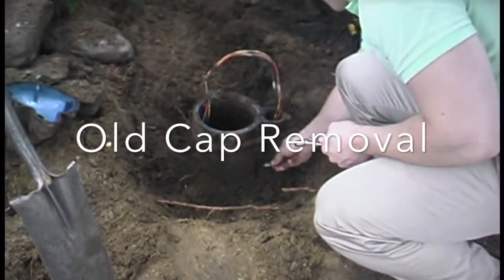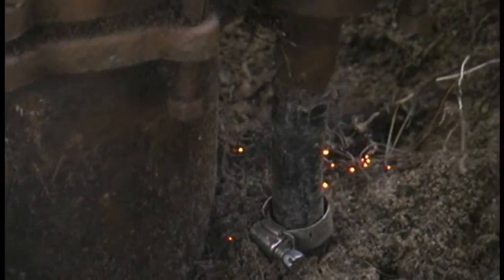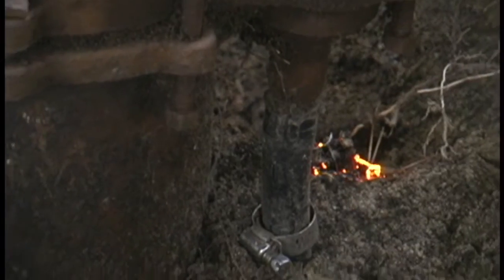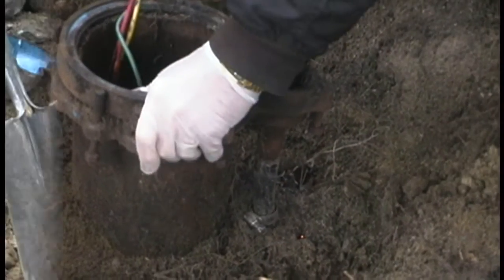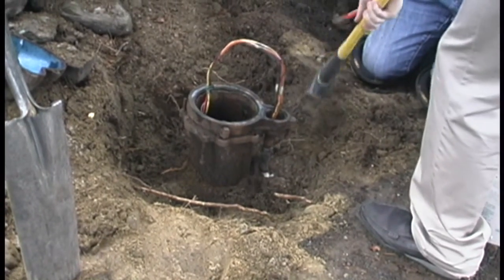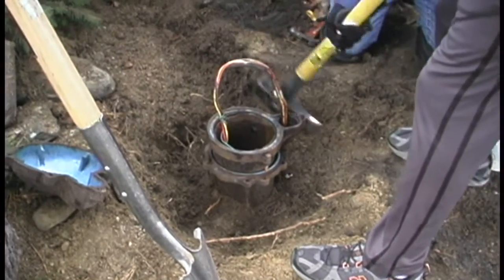So we loosened the electrical conduit and may have to apply a little bit of heat on there. The electrical wires are inside that conduit tube and they are squeezed over a nipple. So if we just heat it up, it will expand it a little bit and we can pull it off. This particular one is really seized on tight. We'll end up actually breaking the old base itself.